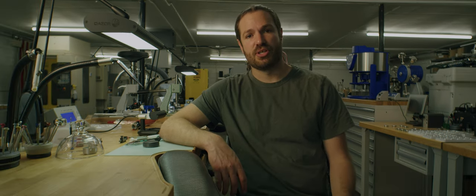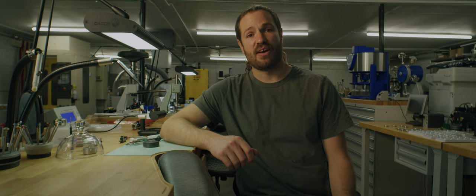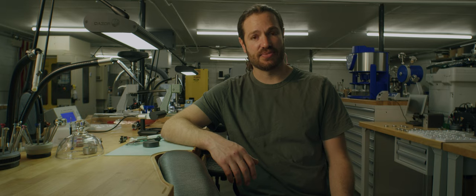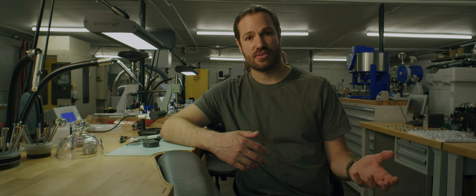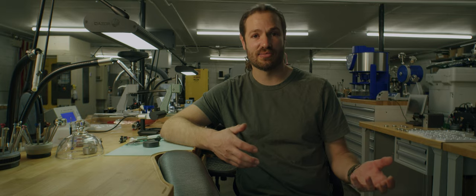When other materials are used for exterior components like cases and bracelets, they need to be corrosion resistant and relatively strong. If you have materials like gold in a modern watch, you will find they are 18-carat gold, because the gold has been alloyed — it's not pure 24-carat gold. That gold has been alloyed with other elements to make sure it's hard enough that it won't deform and fall apart in watch applications.